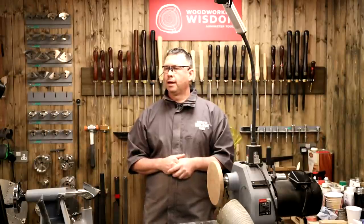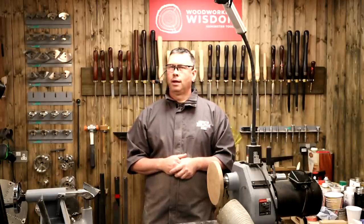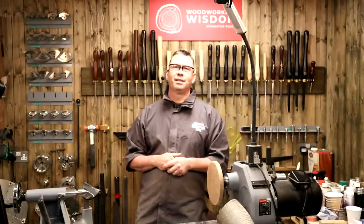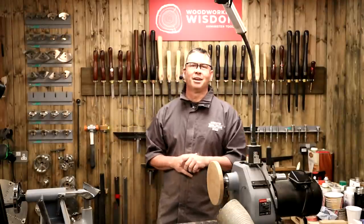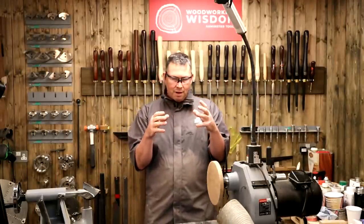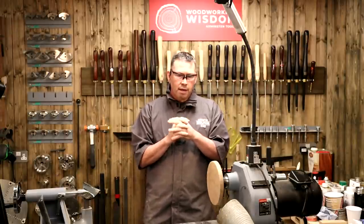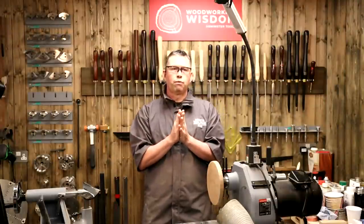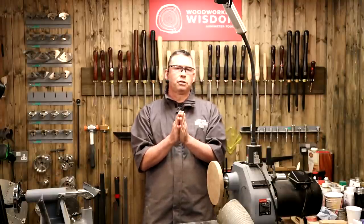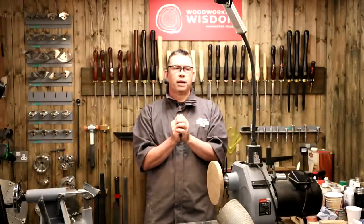Question from Steve. What is the best option to finish cereal bowls frequently used? It's almost as difficult to answer that as if you asked what's the best thing to finish a wine goblet, because they're really, really tricky things. You've got a liquid in that bowl. I would say, if I was doing it, I would probably use epoxy. You'd have to double check with the manufacturers to make sure the epoxy once set is stable. That's one thing I would double check.